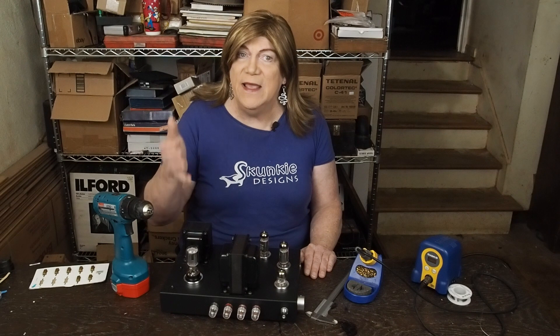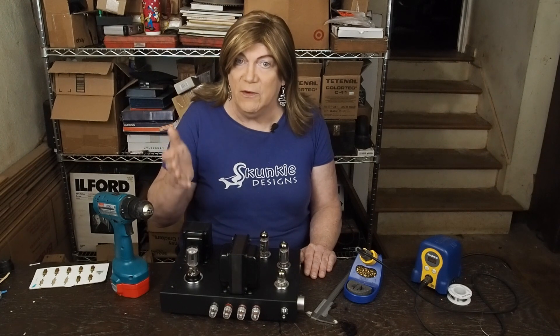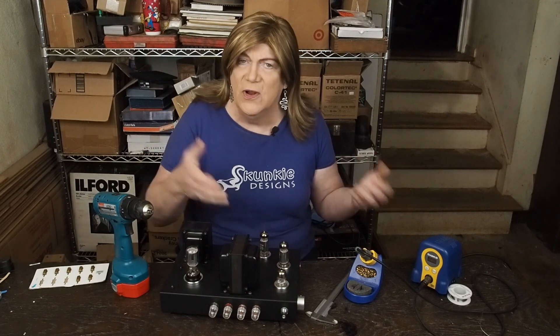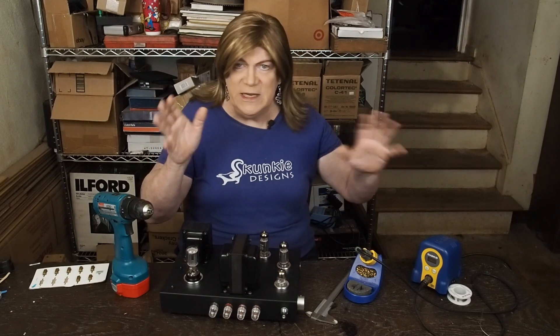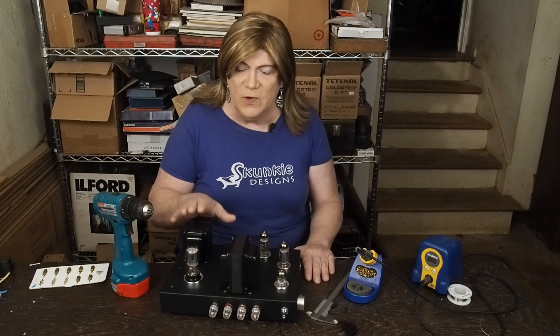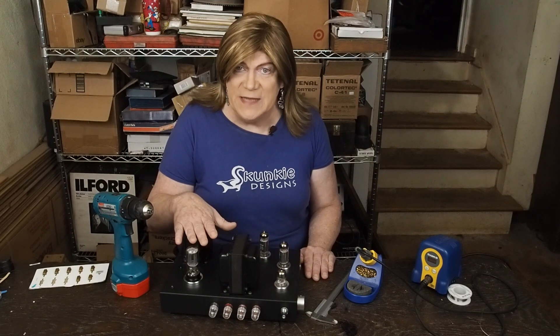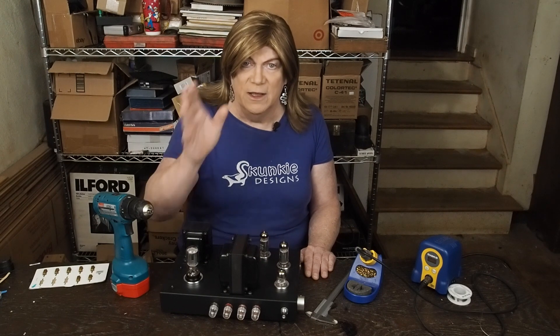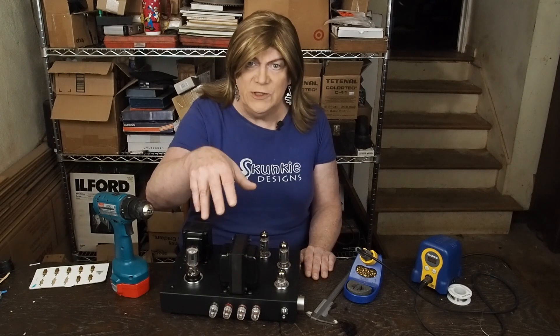While I think there's a lot of snake oil out there on these power conditioners, I believe that if you could hear the noise that these things are claiming to get rid of — mainly what they're talking about is all this crazy noise in your power lines that these things filter out — a tube amp especially has a seriously strong power supply filtering network, at least the ones I build. I've seen some where people use just a cap, one choke, and then a second cap, and I don't feel like that's enough to really get nice clean DC.